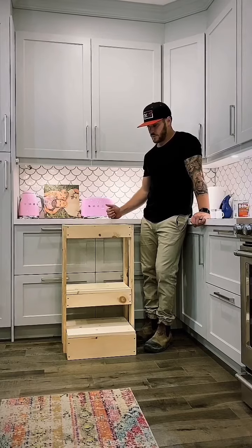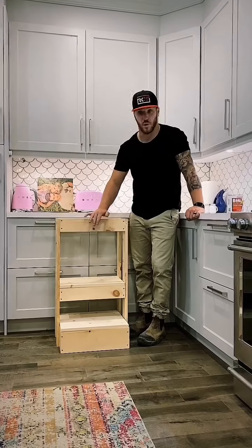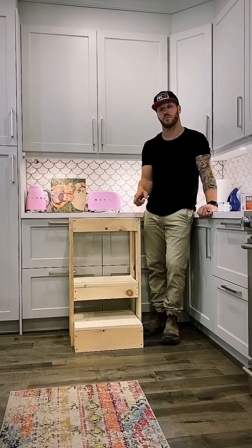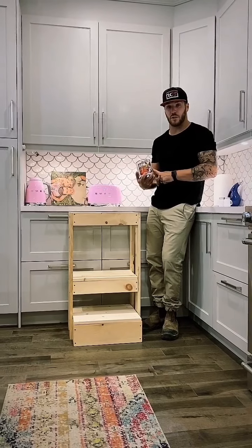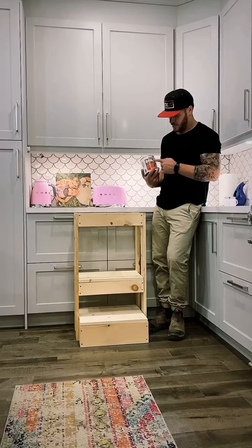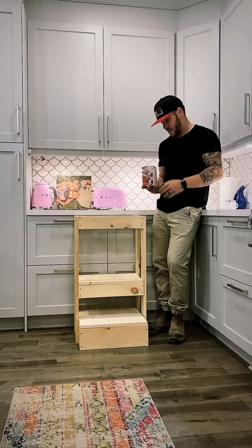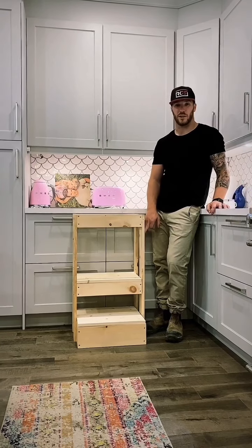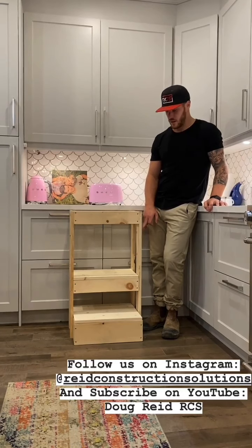For finishing, we're going to paint all the upright and outside pieces white, and then on the top tread pieces she's going to stain them the same color as our hardwood floors. A little trick we learned from doing renos at our cottage: if you don't want the knots to be seen and want it to look cleaner, use stain blocker — any paint store or even Lowe's and Home Depot will sell it. It covers up the knots, because if you skip it, the knots will bleed through when you paint and it doesn't look very nice.